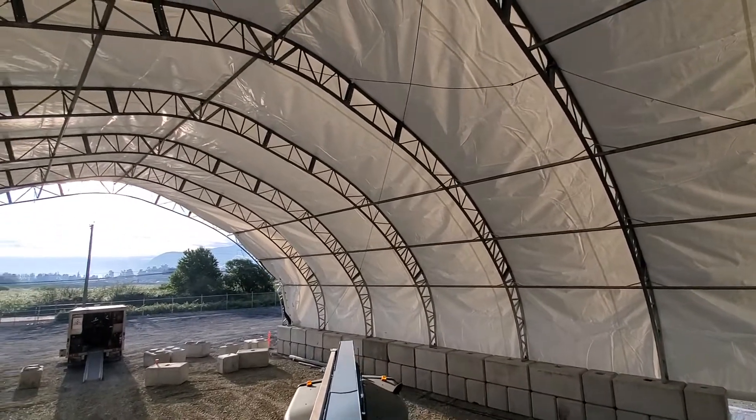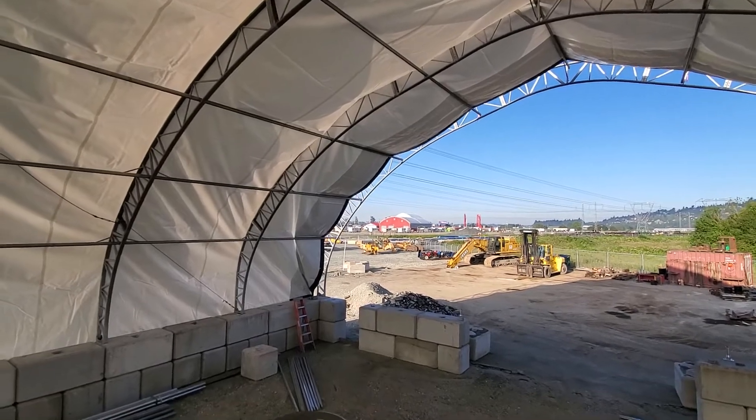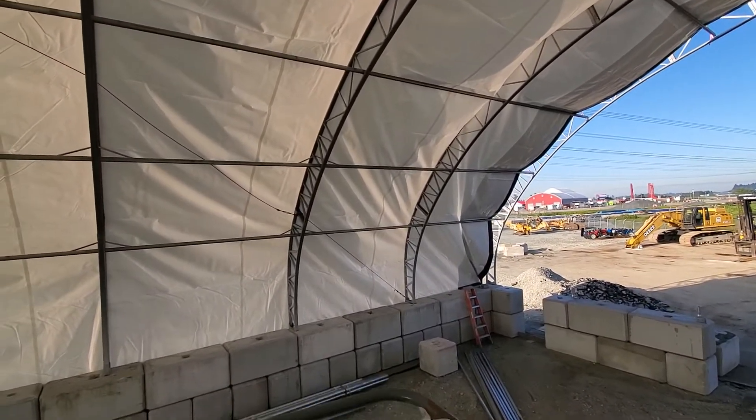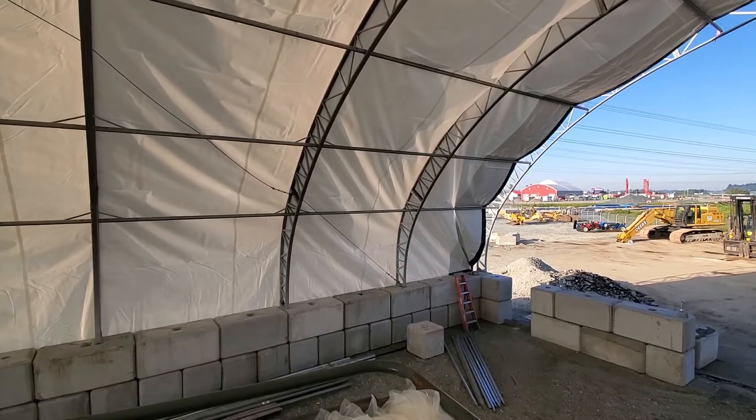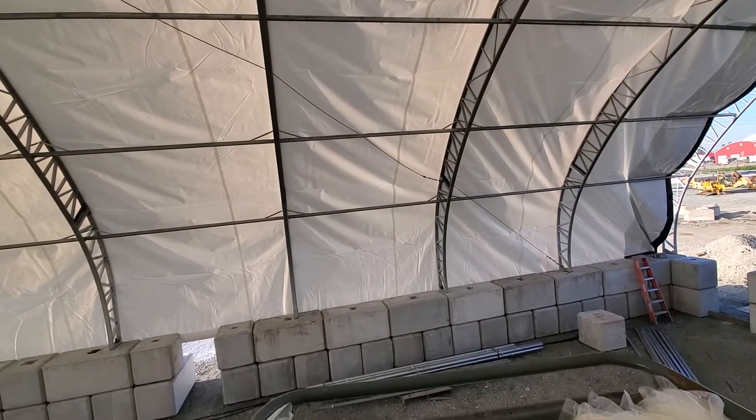I just want to say it's okay to have a couple rows of purlins out. Cable braces aren't in. We can't pull the tarp very hard until those cable braces are in. And there's more work to put them in after the tarp's over the building, but it's so windy here that we just decided this time we can live with that.